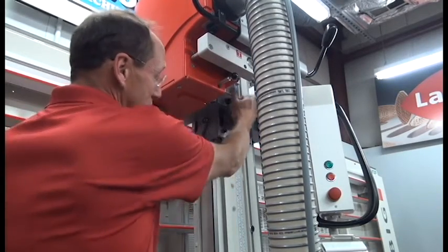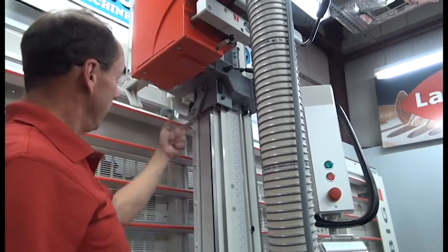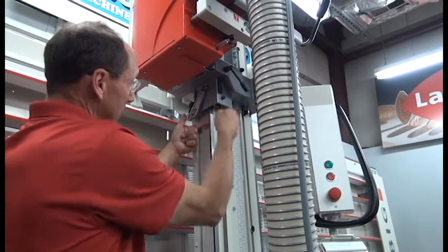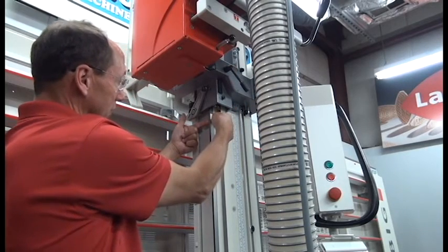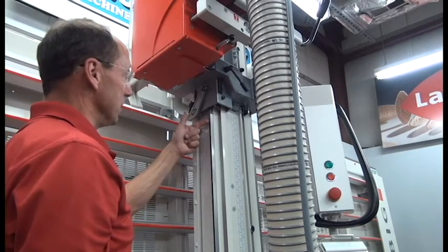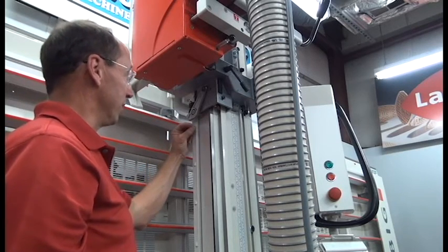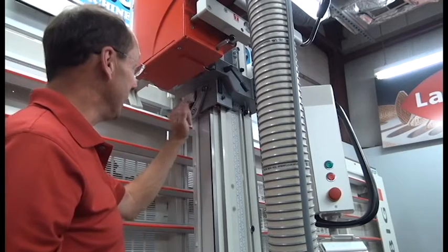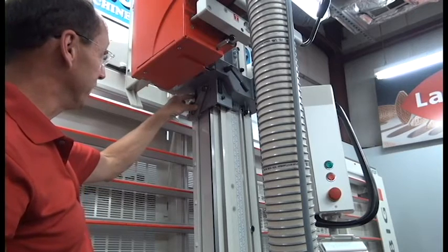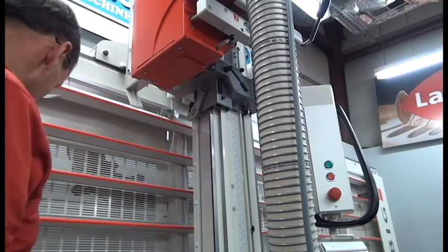I know that it needs adjusting, and to do so I'm going to adjust the screw that acts on the back part of this left rail, where the handle ultimately operates on the front part of the rail creating the other part of the clamp. It's the backing screw that most often needs to be adjusted, and we're going to need to dial that backing screw in clockwise from behind. In order to get at that screw, it's going to be easiest to drop the grid deflecting device out of the way first, using my 4 millimeter Allen wrench.